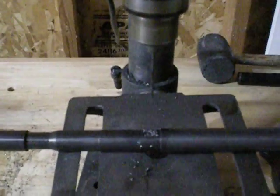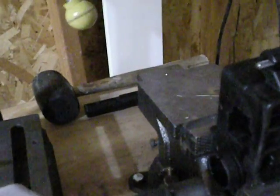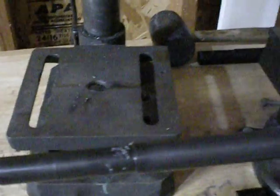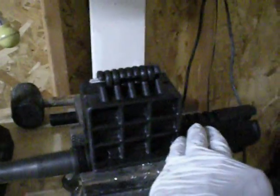The really cool thing about setting it up this way with the block is once you're done, you can just put this table down a little bit so that doesn't scrape, pull the barrel right out with a little wiggling, and you're already set up to put the next barrel back in. It should all be lined up and ready to go. Once you put your gas block on the next one and line everything up, you're ready to go again — you don't have to hassle with the tedious part of getting this leveled and trued up on both planes.